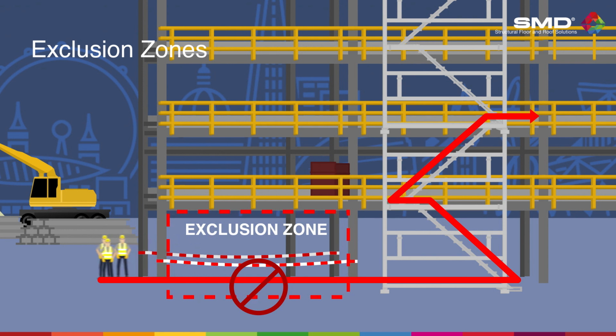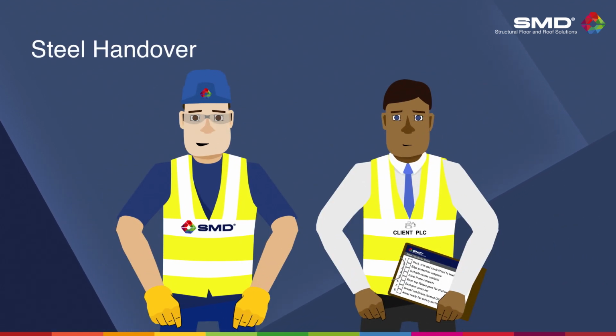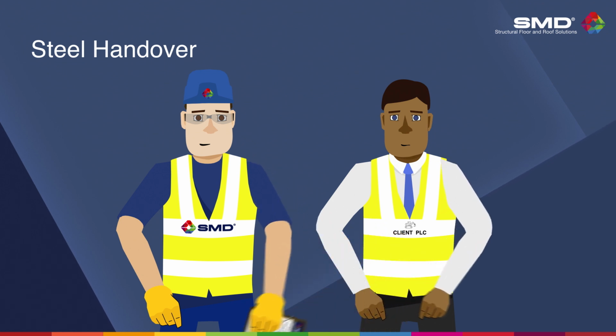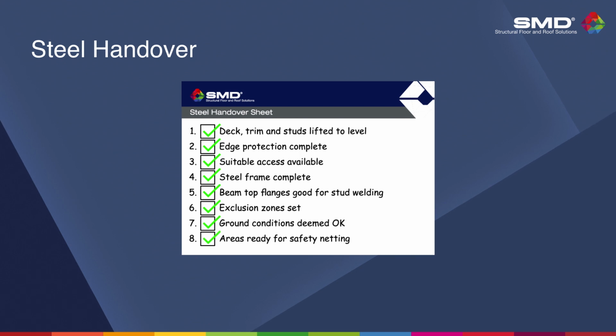We will not allow other trades access to the decked floor until it has been 100% completed and handed over, due to the high risks involved. When an area of the structure that is due to be worked on is safe for work to be carried out, a steel handover sheet must be completed before SMD works can commence.